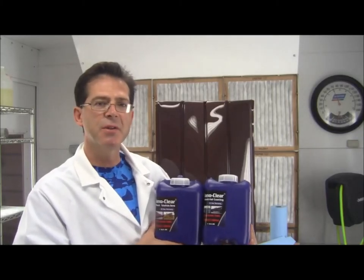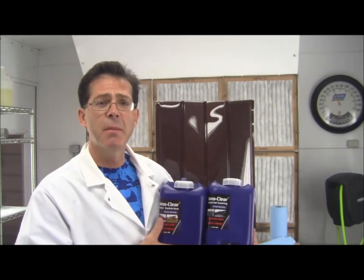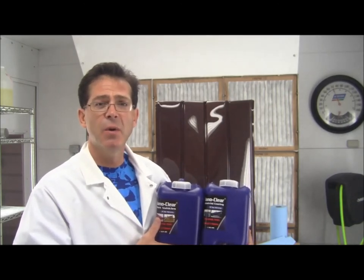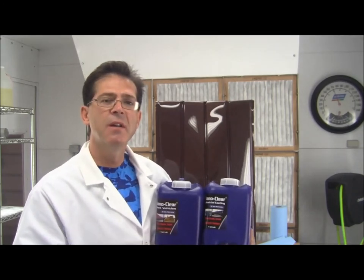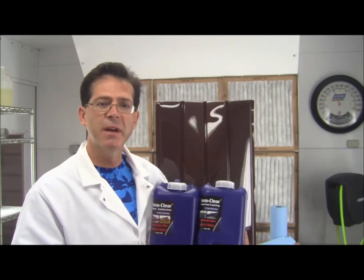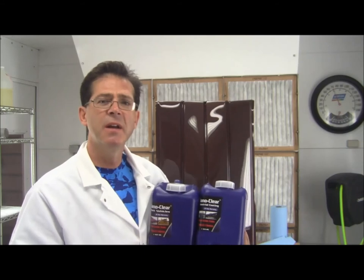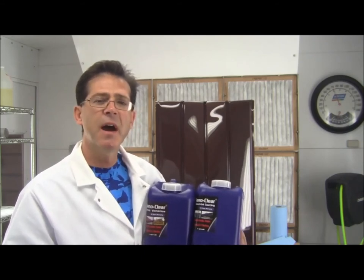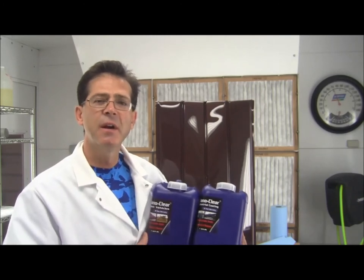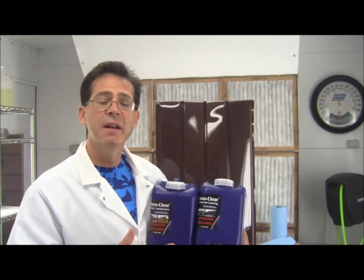Nano-Clear for industrial applications and Nano-Clear for fleet vehicles were designed to be sprayed at operating temperatures above 40 degrees Fahrenheit and below 90 degrees Fahrenheit. The lower the temperature, the lower the humidity, the slower the cure rate of Nano-Clear, because it's a humidity cured system. The higher the temperature, the higher the humidity, the faster the cure rate, which also affects flow and leveling. Ideal spray conditions for Nano-Clear are between 70 and 80 degrees Fahrenheit and between 20 and 60% relative humidity.